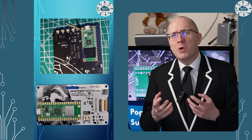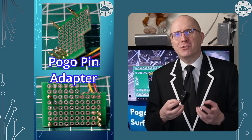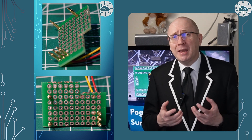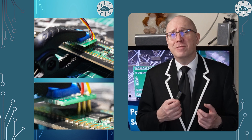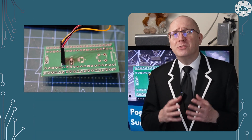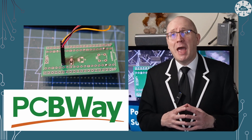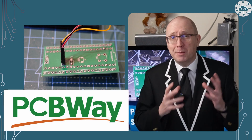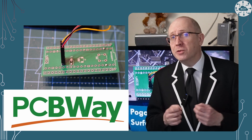I've touched on this before a little when I used a prototype board to patch a very bad pogo pin connection. It was bad because the SWD port and GPIO ports on the Pico W are not on a consistent 2.54mm grid. To get around this, I've had to design a custom but very simple PCB and get it fabricated by our wonderful video sponsor, PCBWay. Stay tuned to see how all this works.